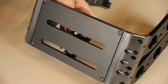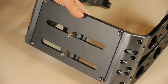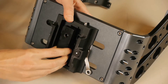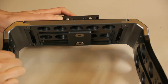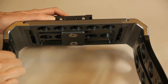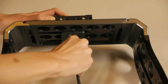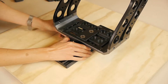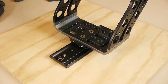It is easier to attach the balance plate with the cage on its side. Hold the assembly together as you tighten the screws. Notice that you can pick your optimal placement by sliding the plate along the cage. We'll start in the middle. Once the balance plate is secure, slide the cage onto the dovetail and use the locking lever on the right side to tighten it into position.